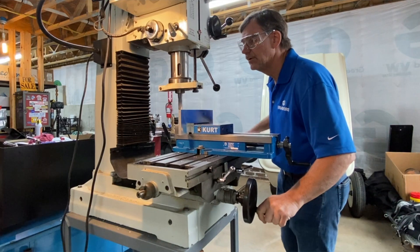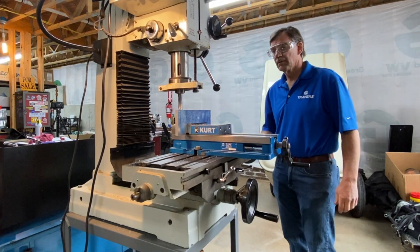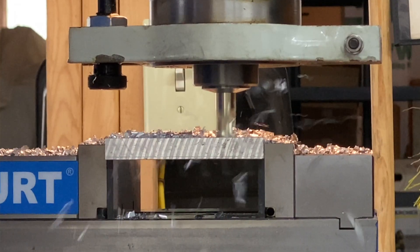If you're really looking to get the best tool for milling aluminum, here are a few tips on what to look for. Since aluminum is so different than steel or other materials, you want to stay away from general purpose end mills and really go with something in solid carbide that's specifically for aluminum.